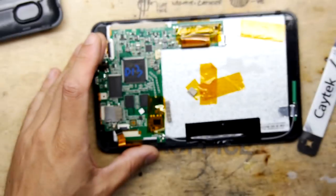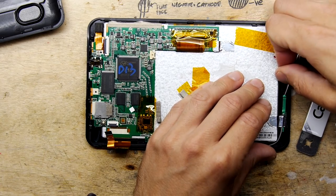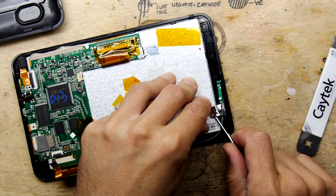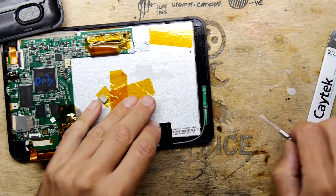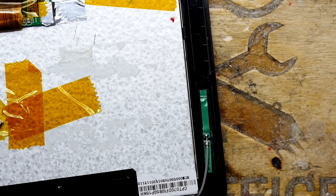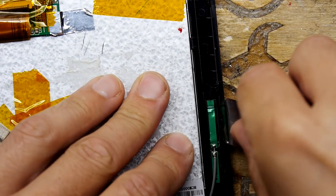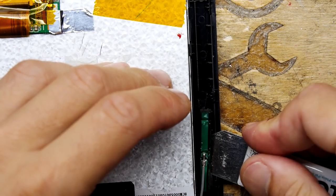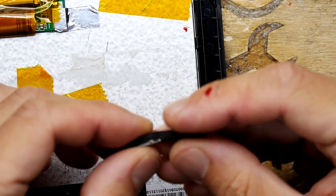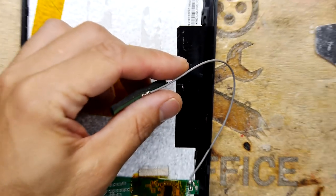My personal favourite, by the way, is the antenna here for the Wi-Fi. It's actually really thin — it's a film antenna. I've never seen that before. It's printed onto the usual flexi-type material. It's going to be a lower quality, but it's just printed on a thin thin piece and plopped onto a piece of foam. That's nice — it's already like a pre-made antenna. If you're doing anything with an ESP module that doesn't have the antenna built into the module, you can use that.